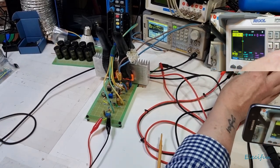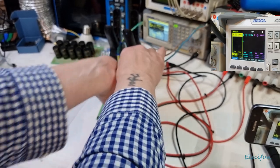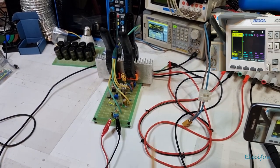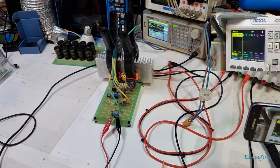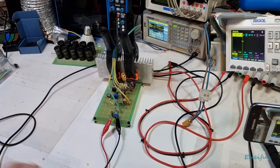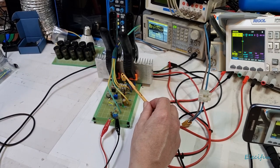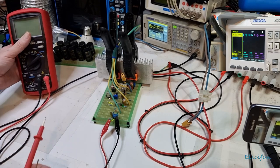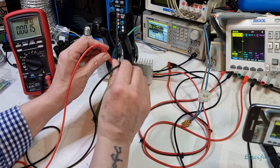So that's part two done. Let's wind that down. I'm going to disconnect this because I don't need it on here now — it's a bit of a heavy duty connector but I prefer it nice and stable. I'm quite satisfied that's okay. Now we want to check the bias current. I don't know whether it needs a signal going in — I don't see why that would make a difference at this stage, since we know we don't have high millivolts. Maybe they mean with an output signal, so let's just do that anyway.